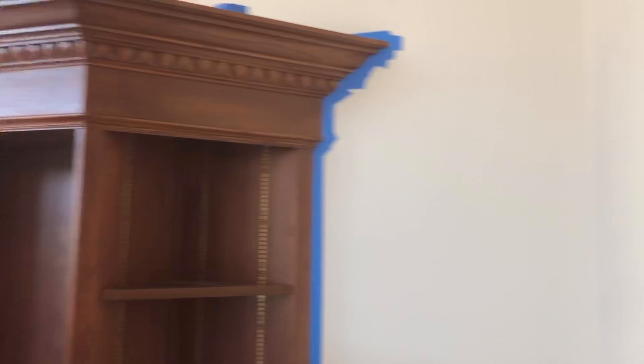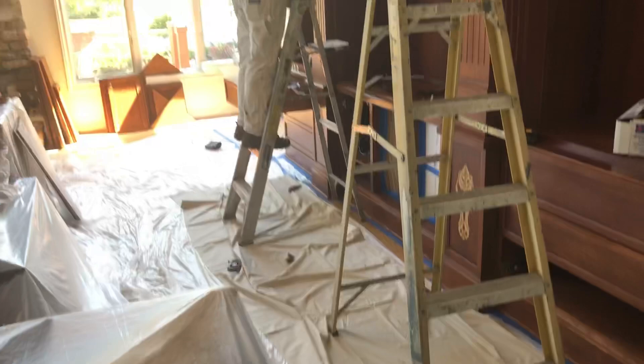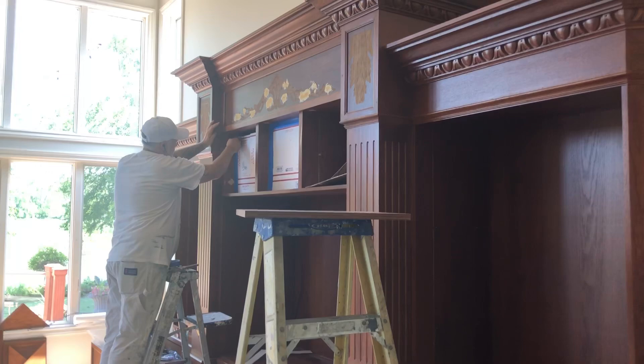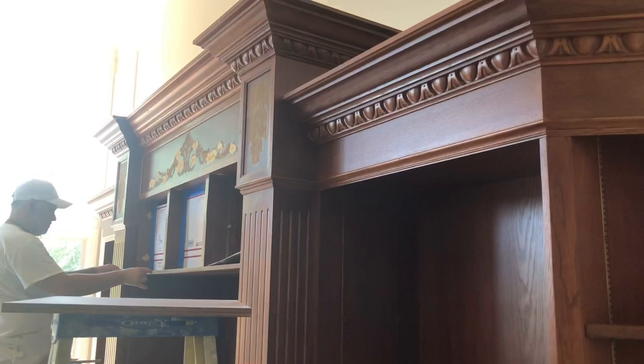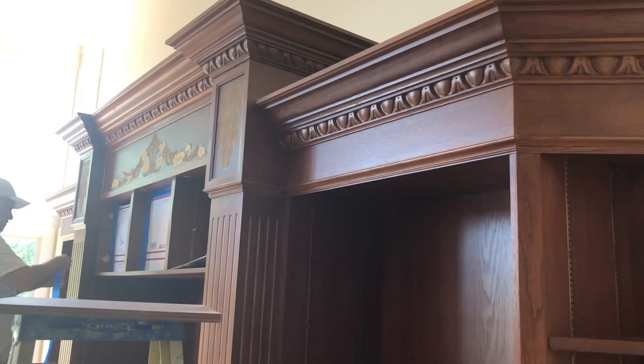We have to tape off the walls. I'm going to put plastic against the walls — we already have plastic down on the floor. I want to do more plastic to protect the area, and then I'm going to break out the high-volume low-pressure sprayer. I'm going to spray this with a coat of bonding primer, let that dry, and then tomorrow two to three coats of finish — a semi-gloss latex, the same color as the trim. It should look real pretty.